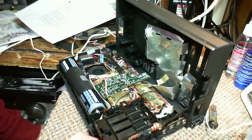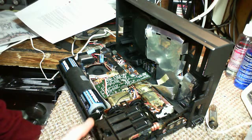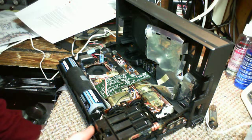A few other parts, though, do get heated up in the process of their operation, and those parts suffer mechanical problems, and the heat itself could cause some kind of chemical changes in the materials involved, and over a long period of time you can get some kind of failure. So it is really all about heat. This is not complicated from that point of view. Heat, mechanical motion, these are the things that kill radios. And also moisture, moisture getting into them.